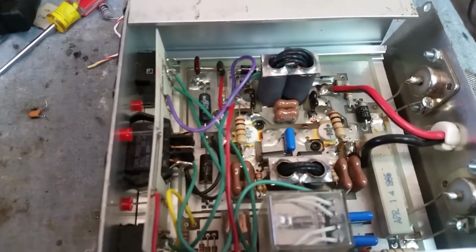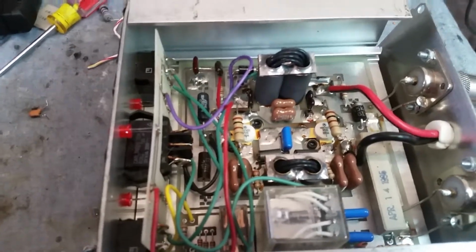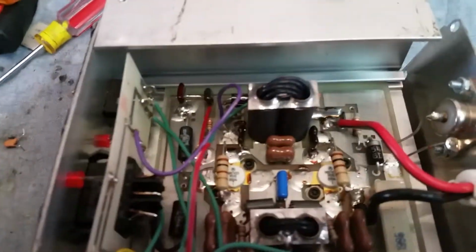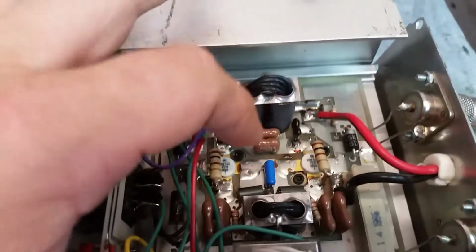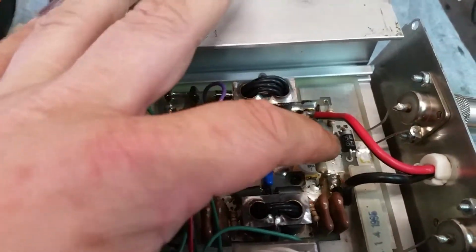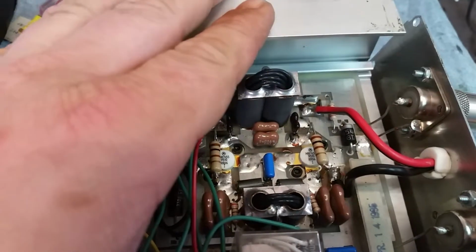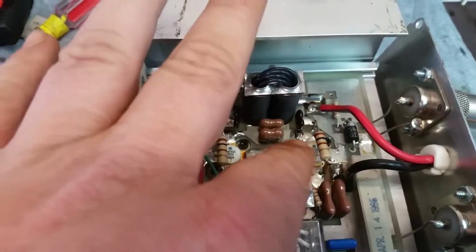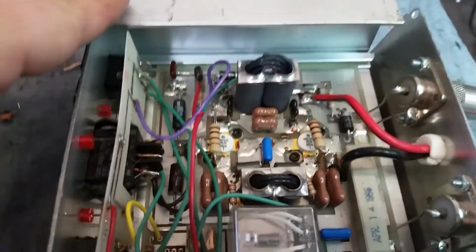It tuned out almost identical to the one I did last week. It had 1446s in it, and this one tuned out to about 57 picofarad. I went ahead and added you some feedback circuits right here. That'll help make the amp a little bit more stable. And also added some 120s right here, loads from the collector to ground for you. The output came up a little bit after doing this, and the reflect came down on the output.